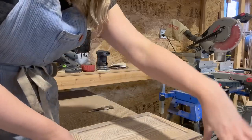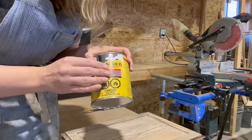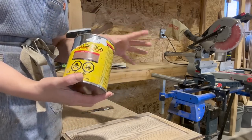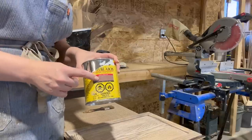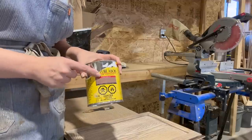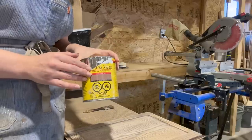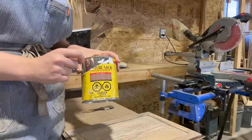And what I mean by that is I'm using Minwax, which I do not like this stain, but for certain things, it's perfect because it's barely a color. And what I need on this piece is a barely color. Now, I feel like Minwax, and if you love Minwax, just ignore me. It's fine. If it's working for you, cool. But in a professional setting, when I look at this tone here, that's what I expect when I put it on furniture. It doesn't do that. This is probably 95% solvent and then 5% colorant. Colorant is the expensive part. So a lot of companies that are in a lot of big box stores, they try to make things super cheap and just use as little amount of colorant as possible.